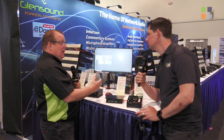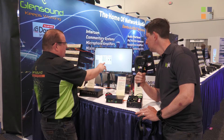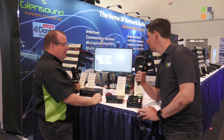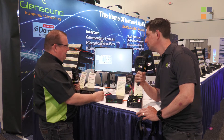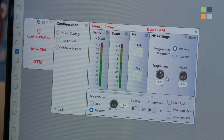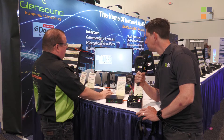There is a clip compressor as standard so any shouting or yelling won't cause clipping. There is also a more traditional compressor to keep mic levels more balanced, particularly useful in a team mix. Phantom power is available, along with settings for the two mic types, gain adjustment, and different bias selections for the headset if required.